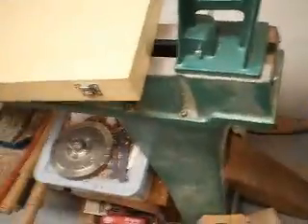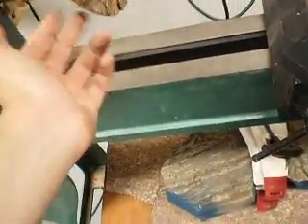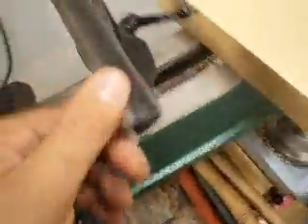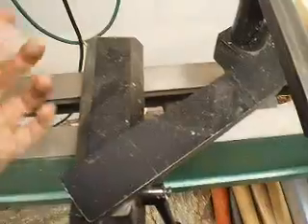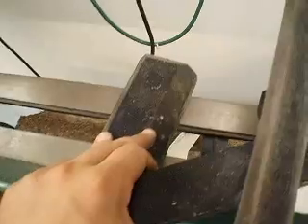It's a decent beginner lathe. It'll swing 16 inches, and with the stock motor it was really too fast — even this bowl would be shaking and rattling at 600 RPM rough-out speed. The treadmill motor makes it a lot better. The tool rest isn't very great — it gets nicked kind of easily, so you have to file it every once in a while. The banjo does lock down and is snug, but there's a nut underneath that adjusts the clamping pressure and it comes loose a lot. They don't have lock nuts with rubber inserts to keep them from loosening from vibrations — two pennies more would've solved that problem.